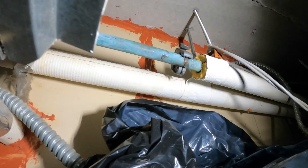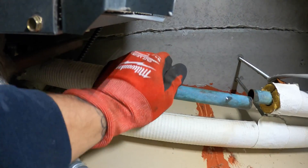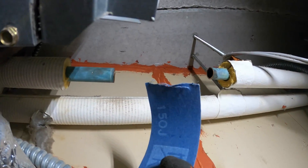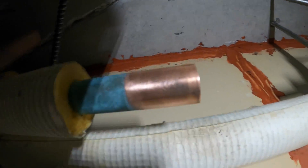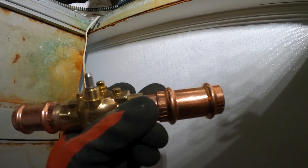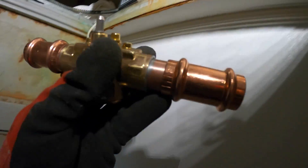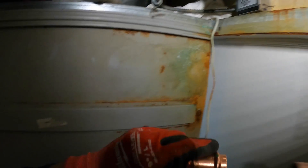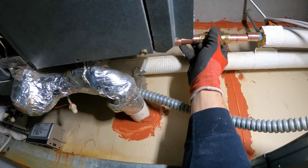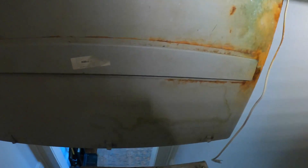Looking good — just got a couple of drips. Looks like we're safe to fully cut this out now. Let's go ahead and sand these pipes down — nice and shiny, no longer green. You want to deburr the pipes. Here I have my valve and two couplings. These are no-stop couplings, or slip couplings, so you can slide them across the pipe. I also marked on the pipe exactly where this needs to stop, because there's no stop here to indicate for you. This fits just about perfectly in here.